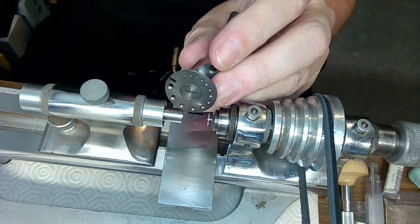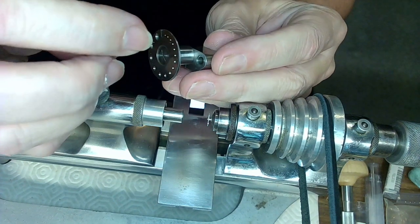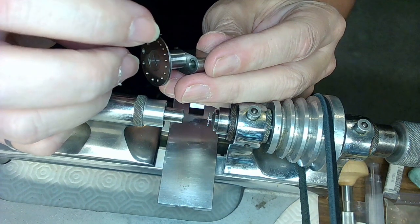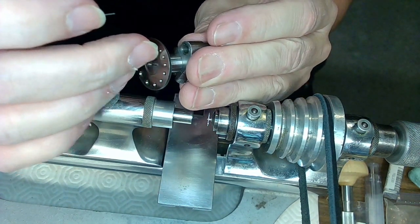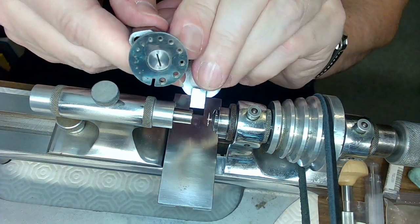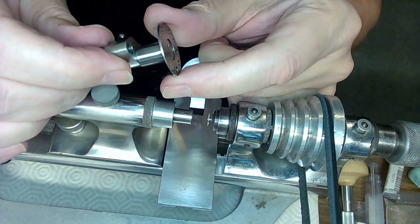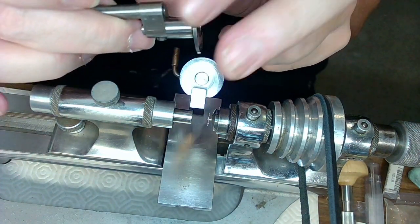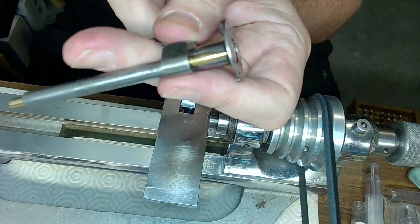All right, the first thing I did with this little part here is I just take my drill bit. I'm not going to do it again, but I make sure it goes through the hole here, which is the perfect size. And I had to go four over to do that, right? One, two, three, four. Whereas before, the drill was way over here. So that's four over. So then I've got to align this, which means I got to loosen that up. And I've got to make sure it's aligned to be four over, which means I need my pusher in there to make sure the darn thing is aligned properly. The alignment stake, I'll call it.